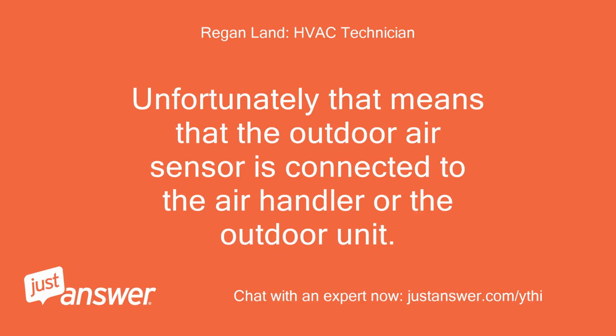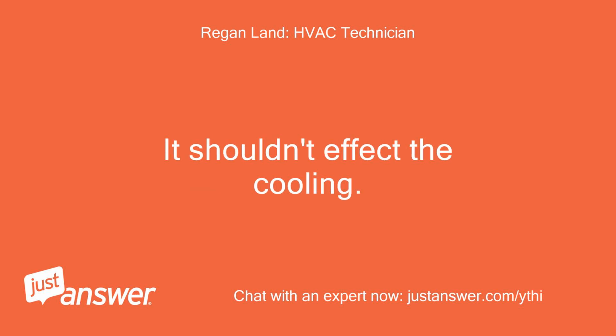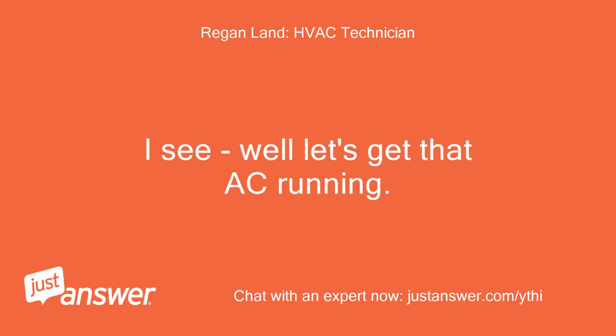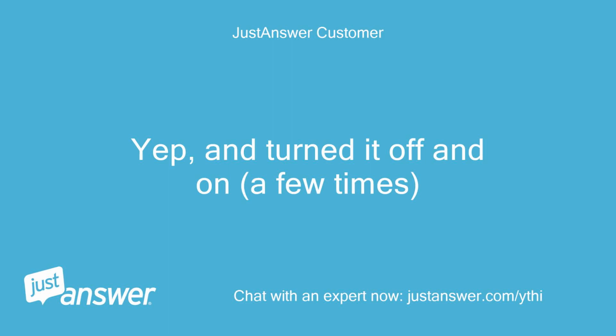Unfortunately, that means that the outdoor air sensor is connected to the air handler or the outdoor unit. That's going to make it difficult to check. It shouldn't affect the cooling. It looks like the AC isn't working though, is that correct? Correct, the fan will go on, but the outdoor unit will not. I see. Well, let's get that AC running. To start, have you checked the breaker to the outdoor unit? Yep, and turned it off and on a few times.